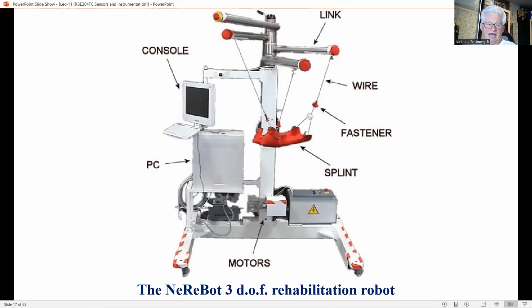To increase the SN ratio, the light is first filtered so the camera actually sees mainly the reflection from the markers. Since not all markers can be seen at the same time due to occlusion by the test person, and since all markers are identical, spatial tracking algorithms have been developed to identify the tracked body part. Accuracy requirements are not severe. Processing speed is a more important issue, since fast movements must be tracked and analyzed.